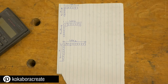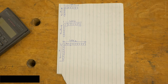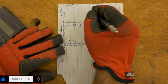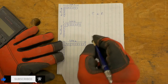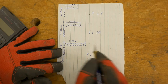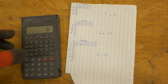The next thing we need to figure out is how many pieces we want to have along the width and along the length of each board. And since I'm a golden ratio fanatic, I use that to figure it out. The three numbers that I found work are 5 along the width, which will automatically make the length 8, 6, which will make the length roughly 10, and 8, which will make the length roughly 13. And the reason I say roughly is because there is always a rounding error, as we can see